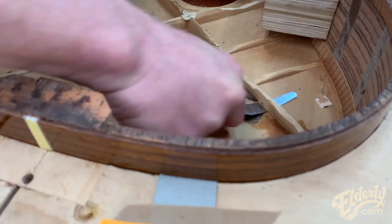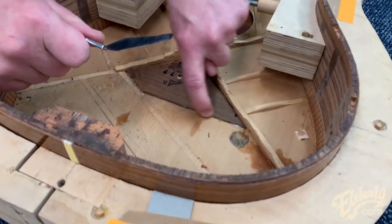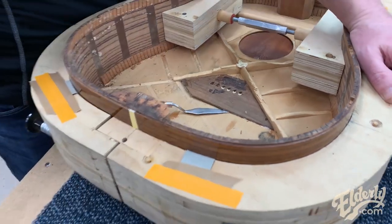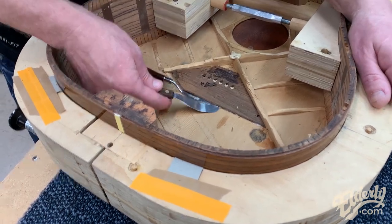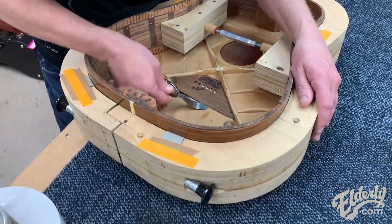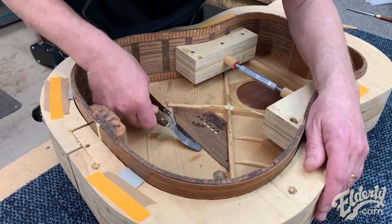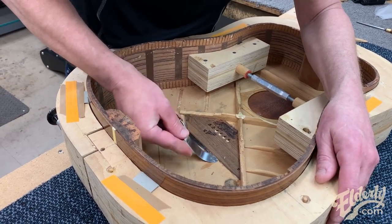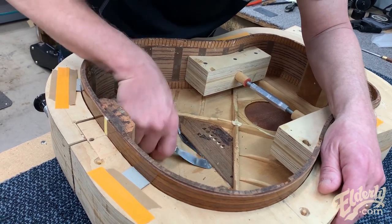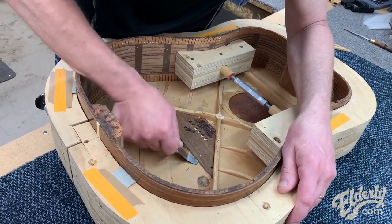So I've got the brace up to the bridge plate here. Now, it's going to be a bit of a challenge to come into the bridge plate from this edge, and that edge is still pretty well glued. You can see from this side where I've got the bridge plate. One thing that is helpful with multiple knives is to get one in there and have it act like a bit of a fulcrum while I begin work on the glue line right beside it. Every once in a while you get lucky with a thing like this bridge plate, but I have to be prepared for the probability that it's going to come off fractions of an inch at a time. Wouldn't it be nice if I could pop a large section of it off and have the glue release?